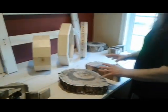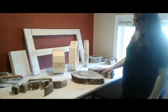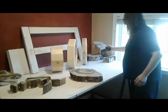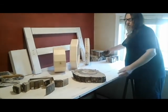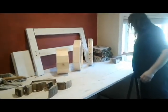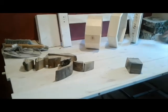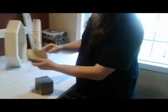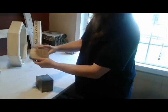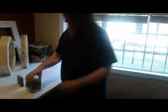Because of the way the wood was cut, I have to be very concerned with the direction of the grain and how I mill it to turn it into a wood frame. What I do is make sure that the pieces from this type of raw wood are cut into a shape small enough where the wood grain is not an issue. I cut it into smaller chunks and section it out so that I get smaller pieces of this size, which still has an excellent grain visible that I can turn into a lovely drum.